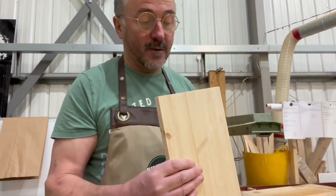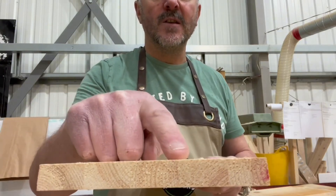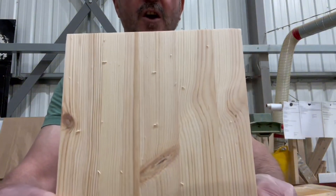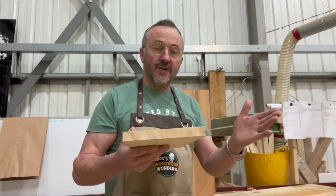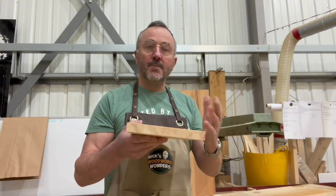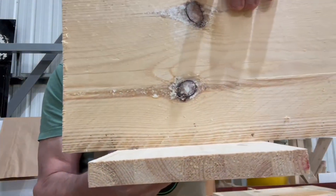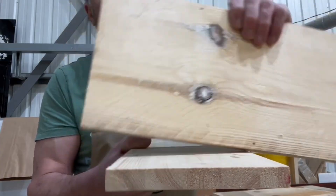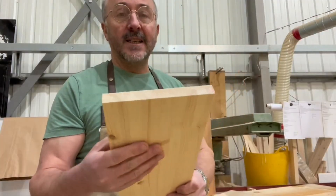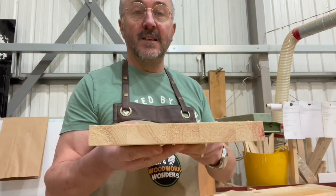The alternative to that is laminated wood. You can see there are strips — one, two, three and so on — strips of timber that have all been glued together. It's not one piece; it's strips that have all been laminated together. What this does is it keeps it a lot more stable and stops the timber from moving, so you get virtually no movement. You can see that it's perfectly flat. It's been in the workshop and as you can see it's cold in here this morning, but it just doesn't move with any changing temperature.